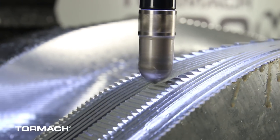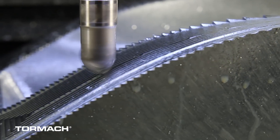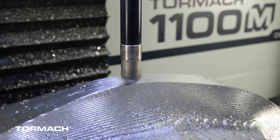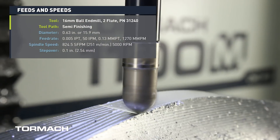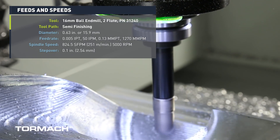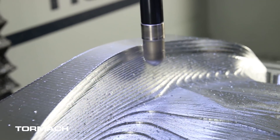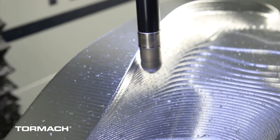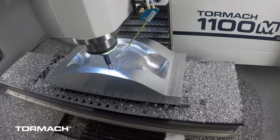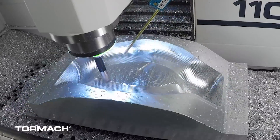Once those little pockets were cleaned out, we started semi-finishing. One of the important processes when machining a mold is ensuring a consistent amount of stock material before your final finishing passes, so that tool load stays consistent and surface finish improves. The debate is always which strategy works best — a raster pass going back and forth, or a 3D offset/scallop style that collapses down onto the profile. Variables like machine characteristics and part geometry all factor in — it's the kind of thing you argue with yourself about while programming.